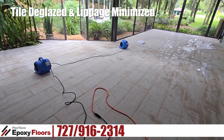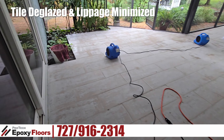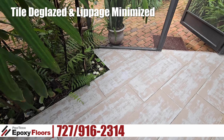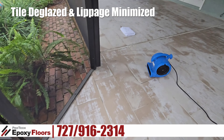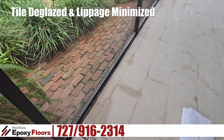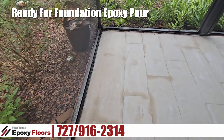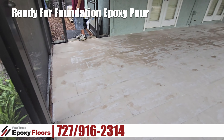You can see that's what we're doing here — we have air movers and stuff on the truck that we keep because it's not uncommon to get different moisture in different spots. It's been a pain in the neck just because we'll get it dry and then it tends to drip down regardless. But you can see everything is all prepped out. All the lippage has been removed, or as much as possible — you can't get it all, just like you can't grind down past the grout lines. It's just part of the floor, but we try to minimize everything. What we're going to do next is put down a float coat of epoxy that you'll see in the next segment.